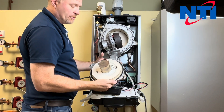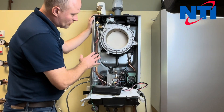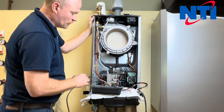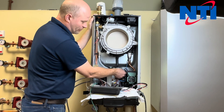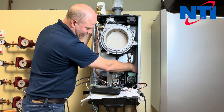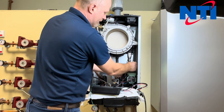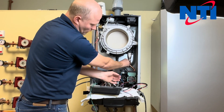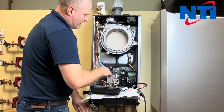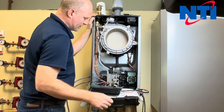Now is a good time to inspect both the burner and the combustion chamber and clean it if necessary. Now that the burner door is out of the way and we can see what's going on inside the boiler, let's remove the wire harnesses that are going to be in our way. Start by disconnecting the diverting valve by pulling on that. If you're reaching back here, the water pressure sensor — you can pull that connector off and disconnect it. Take off the wires to your return water temperature sensor, pull these off to one side. Disconnect the pump and pull it off to one side.